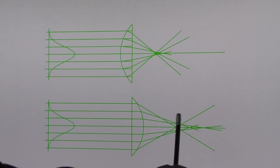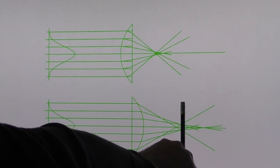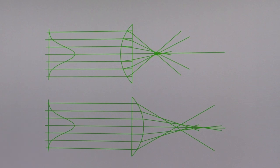If we run at low speed, then not only will we get this burning effect, but we'll start bringing in more and more of these, because the slower we run, the more the exposure time, and the more of this we will actually include in the burn of our line. So that clearly explains why we get what appears to be a variable focus depending upon speed.